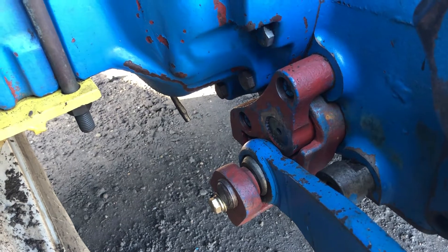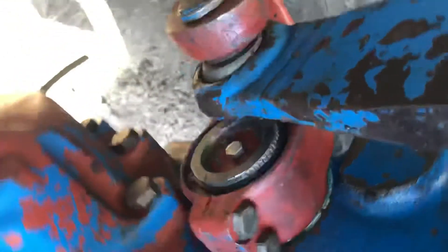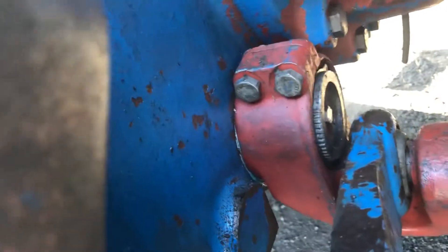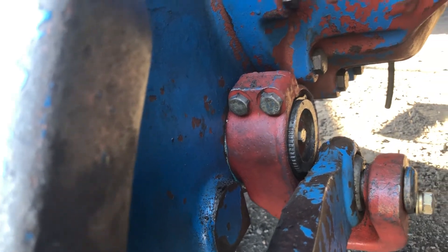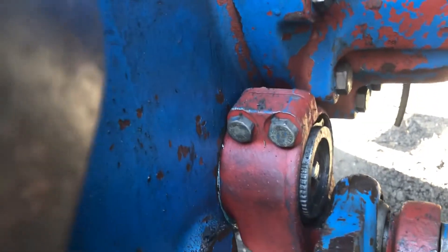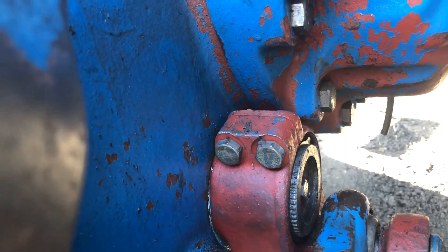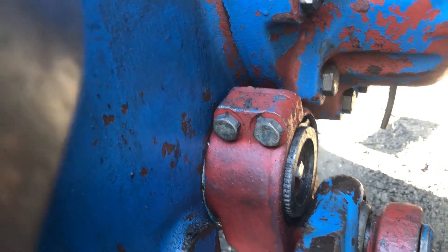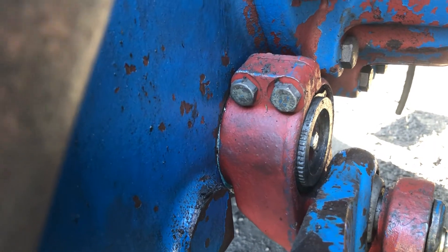So this year we finally did the repair. There are options to just basically take the clamp off right here, slide the shaft over, stretch new o-rings over. But the real problem on most these tractors is that the rock shaft blocks on the right hand side on the earlier models were not clampable, so they would rock on the shaft so bad that you'd get all kinds of weird pounding action - and if you go far enough, you could actually have it strip. So we got used parts from Alexander Tractor Parts out of Texas.